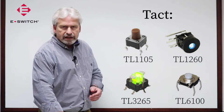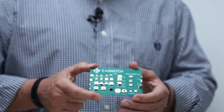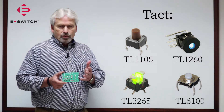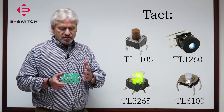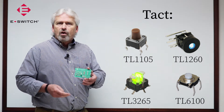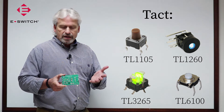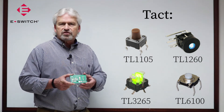The last product category that I'd like to discuss are tact or what we call tactile switches. Tactile switches are used in almost all applications. This particular board features some of the smallest profile tact switches that we have. We offer right angle or vertical, illuminated and non-illuminated type switches. Some of these now have an IP67 sealed rating. Some of these are small enough to be used for handheld or wearable type devices. The largest type switch is 12 millimeter square. These are low power rated switches, 2 milliamps and typically less than 12 volts.